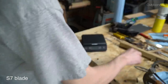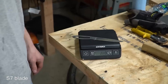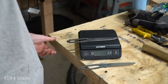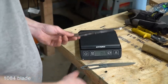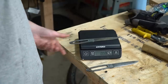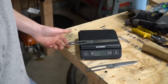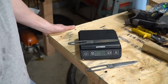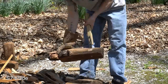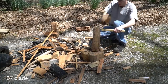After grinding the bevels, check this out - 2.2 ounces. That is a tenth of an ounce lighter than this one, so we're really close in weight. That's a lot lighter than I thought it would be considering the stock thickness we're working with. If we can get scales on this under three quarters of an ounce, we're under three ounces for this knife. And here we are back out testing the S7 blade - another hour passed hitting this blade as hard as I possibly could with zero breakage.